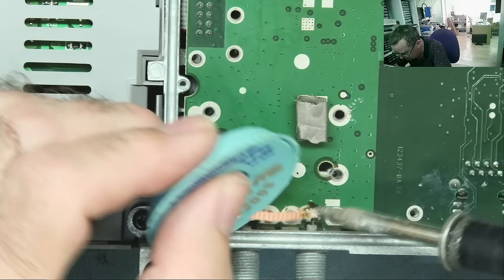Let's look for that other number. ST and then 60342. Okay. Oh, Lego. Circuit breaker, no. So about the only clue I have is it could be an LM2904, though I'm not totally convinced that is actually the case, but it could be, with one inverting and one non-inverting input connected to ground, sort of would make some sense, I guess.